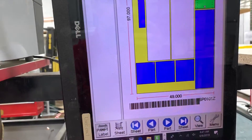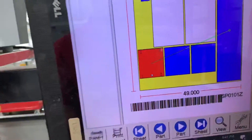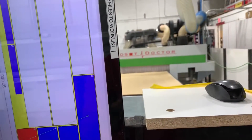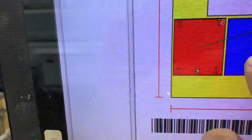The big question was label orientation and how Cabinet Vision is set up for us. This might be unique to the six-sided machining post on the auto-load machines, because my Cabinet Vision guy had never seen this before. On each part you can see right here there is a dot, and when we zoom in on a close-up of the label, it's actually a clock.